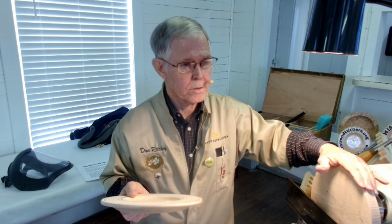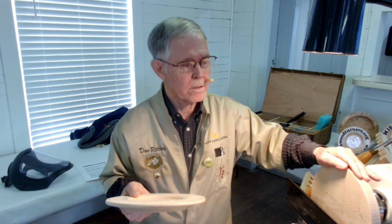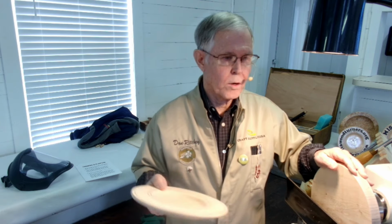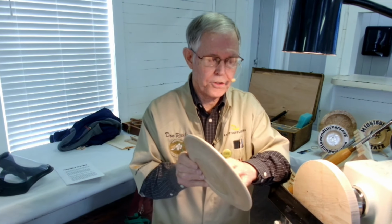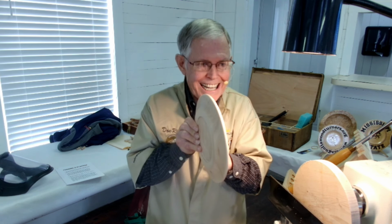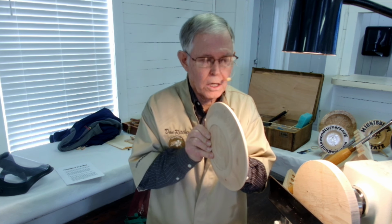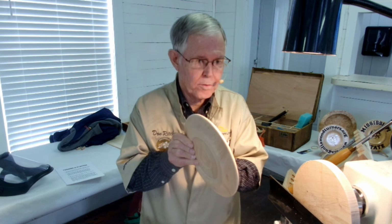Have you ever used hot melt? No. Does the piece where the vacuum chuck goes need to be planed off super flat, or can it still work for suction? Well, when you put it up against the vacuum chuck, you put a piece of rubber on it. If it is a little bit rough, that thin piece of rubber pats down in there and tightens it up, and it's not going anywhere. Unless you get a really bad catch, I've never had one come off my vacuum chuck.